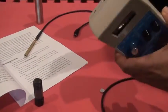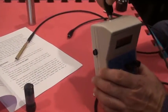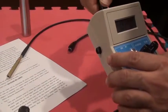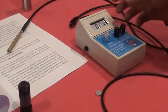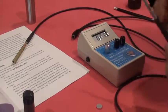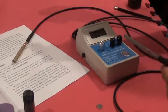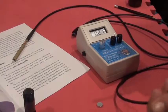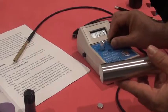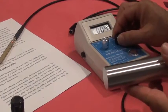Now this is a connector for my axial probe. As I mentioned, you follow the direction of the pin and insert it into the meter, and you're supposed to hear it click sometimes when you put it into the meter. Now this is the axial probe. In general, as we said, we have to zero our meter to avoid a subtraction measurement. Now if we are measuring around MRI, we have to put my probe inside the zero Gauss chamber, zero it, and go to zero reference.